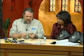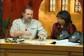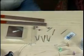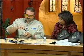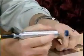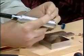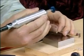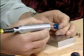Now, one easy way to get to really high polish is using these radial bristle discs. These are a rubber, actually, that's impregnated with an abrasive compound. This blue one here is a 400 grit. And they work really well, especially in a flex shaft. Just put that in there. And a drill? This is a flex shaft, kind of like a drill. A handpiece, this is a Jacob's chuck, which is like a regular house drill. And you can fit any kind of bit in there. It's operated with a foot pedal, so you have a variable speed from real slow to really fast. So it makes it really easy to do.